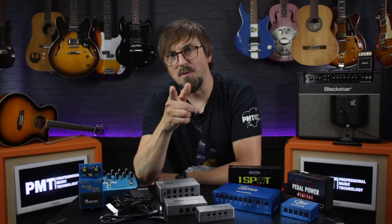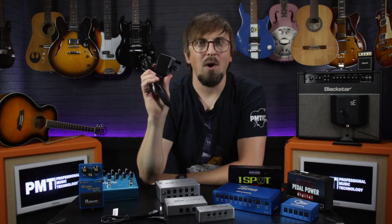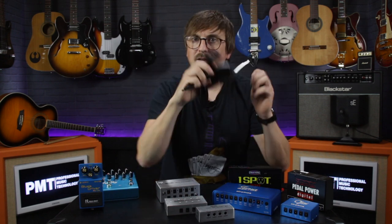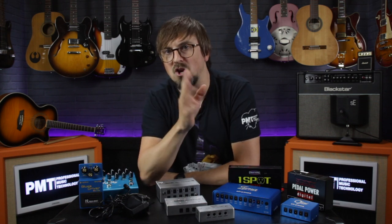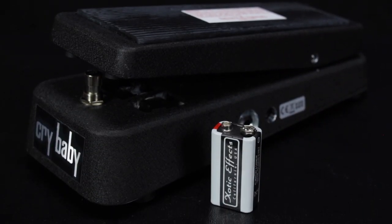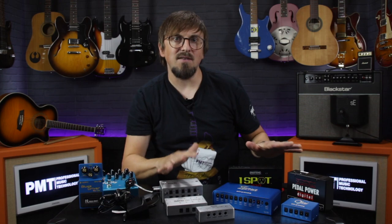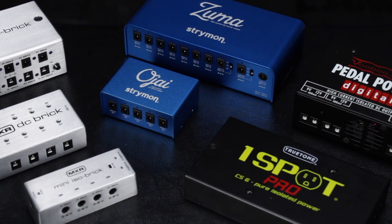So what type of power supply is right for you? Honestly, if you've only got a few pedals and you're just playing at home or in a garage band, a simple AC adapter and daisy chain will probably do the job as any extra noise might not be too much of an issue. Don't forget, certain effects like wah pedals have such a low current draw that a 9V battery will last for ages, so batteries are still an option to free up outputs for more current-hungry effects. But if you're looking to build a pedalboard with lots of effects including non-standard voltage pedals and you want to keep the signal noise-free — which is essential for gigging and studio work — then you're definitely going to need a dedicated isolated power supply. In that case, go and watch our best power supplies for pedalboards video, which I'll leave linked in the description.